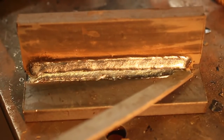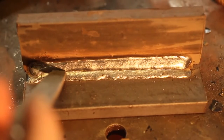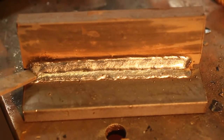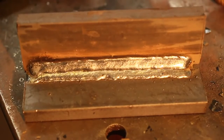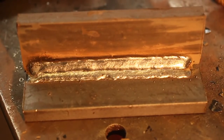I'm looking at, when I'm finished, the center of my 2 welds line up with what would look like the center of this joint. So my first weld goes directly down the center, and then my second one ties into the toe of that weld, and then the third one ties into the toe of that same weld on the top. I know that can all be confusing, but hopefully from the video you can see how first one goes in the center, second one on the bottom, third one on top, and you would just continue to repeat that process with the exception of the initial first pass.